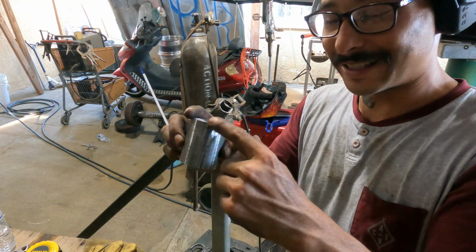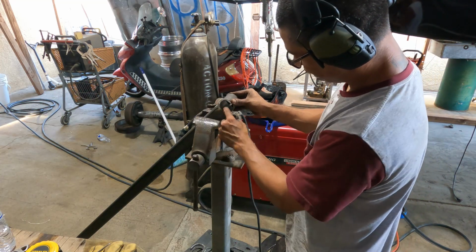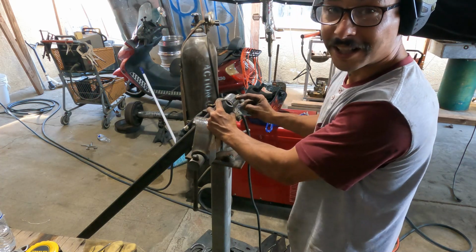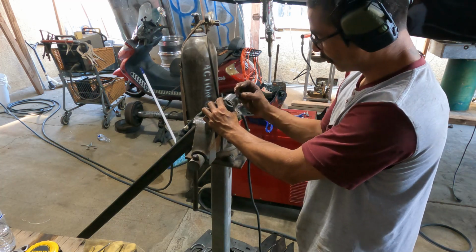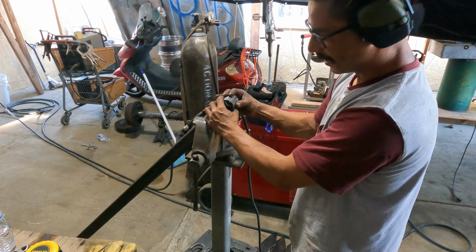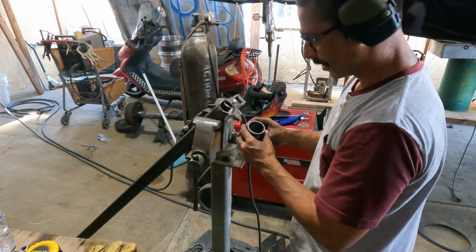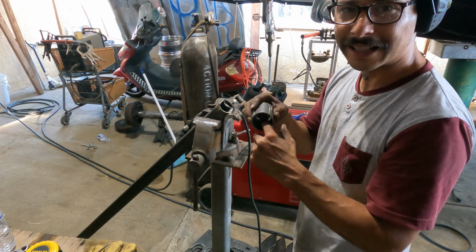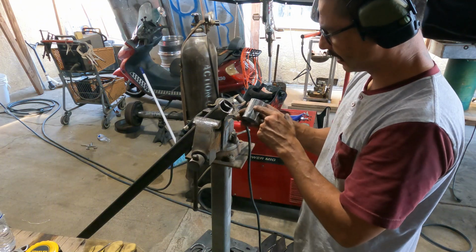That's the seam where the piece of metal gets wrapped around and welded together. So that piece needs to go in the center of there, so that when you weld around, it is locked in the weld. If you were to put it out here, you have the liability of it splitting. You see what I'm saying? I see a lot of them like that, people do them. Even when you're welding a bolt to it and making an adjustable one, you weld the bolt as close to that center as possible. You want to lock that in with the weld.